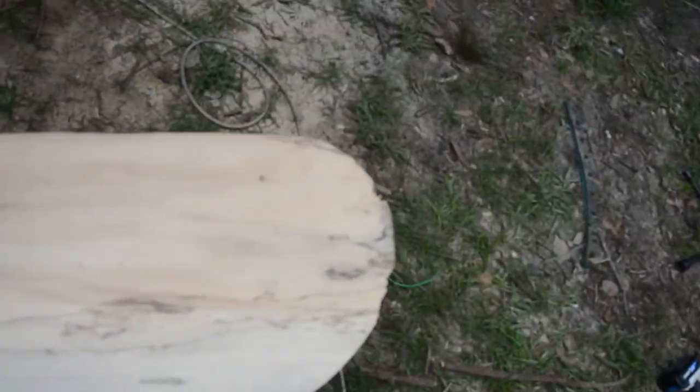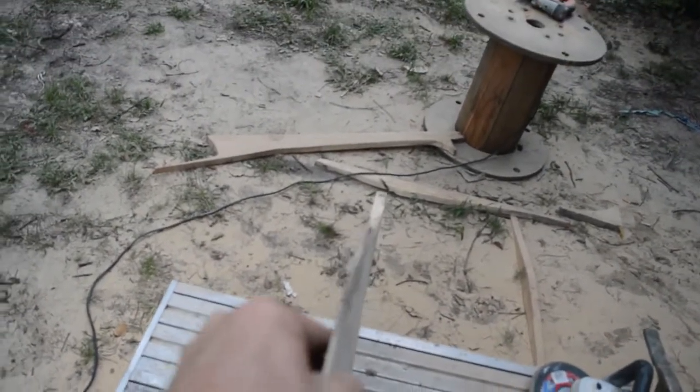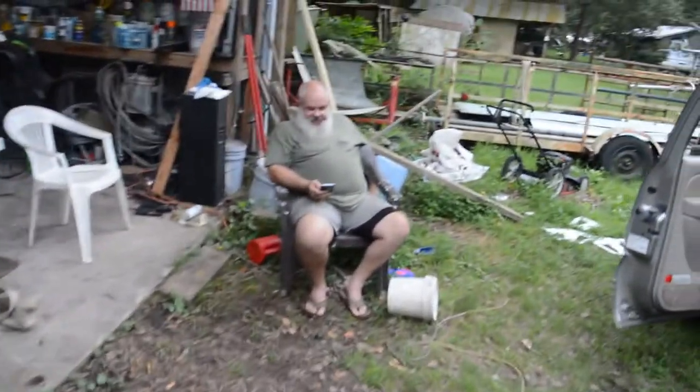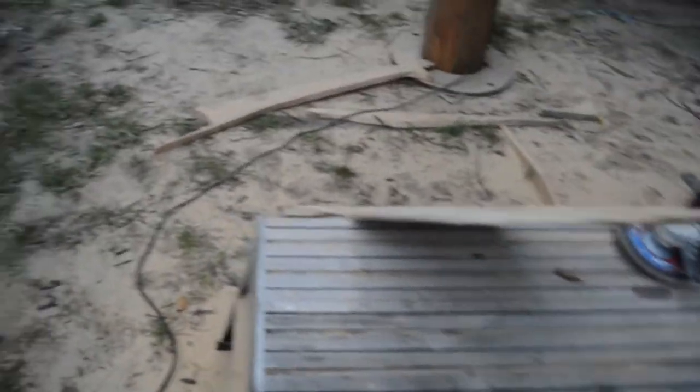This is footage from after I'm close to done — not quite, but much closer. I haven't done much with the head of it, but I've worked primarily from the trailing edge toward the front. The back is almost an eighth of an inch thick, maybe three-quarters of an inch wide on the sides right now. I've been leaving a little room because I'm going to wrap this thing with fiberglass. This wood has been drying in a dehumidified trailer for ten to fifteen years — good dry wood — so it should soak up the resin well and the glass should make it strong and long-lasting.